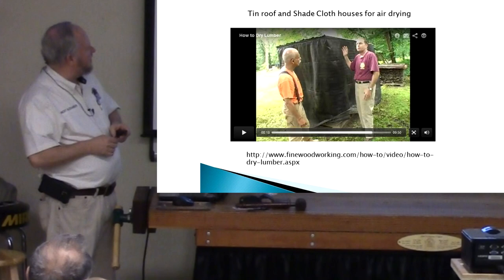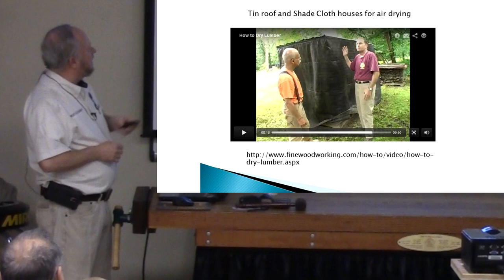You don't want to leave the fans on for a real long time because that's too fast — you'll start splitting the wood. So a couple of days to get that free water out is fine. The water that's left has two hydrogens and wood fiber has a lot of hydroxyl groups, so you have van der Waals forces. It's much more difficult to get that out — that takes about a year to get down to 12 percent. We've found that even for an inch and a quarter.